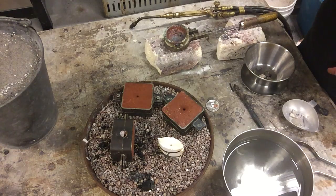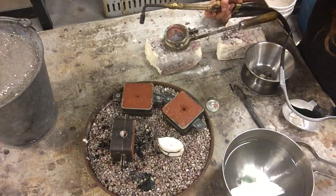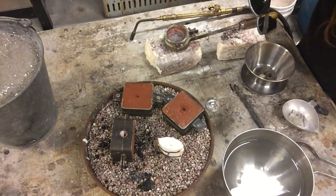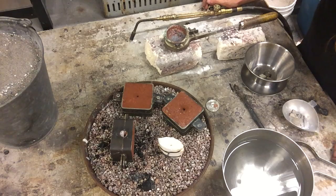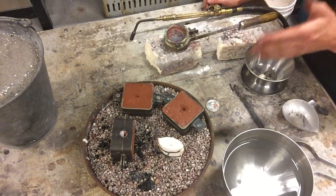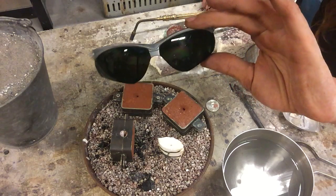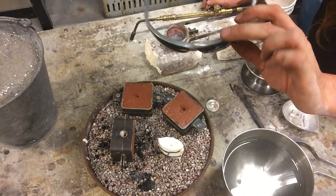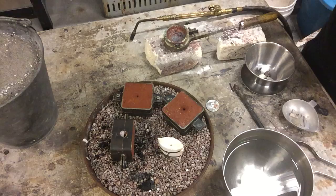The last thing you need is a pair of safety glasses. When you've got a torch hot enough to melt metal, it's also hot enough to burn out your corneas — so use a level three or level five shade depending on your eye sensitivity. You can also get glassblower's glasses which take out the sodium flare and let you see the color of the metal. This pair is green, so it's harder to tell the metal color through it — it's better for experienced people, but hopefully the camera will catch most of what we need to see.